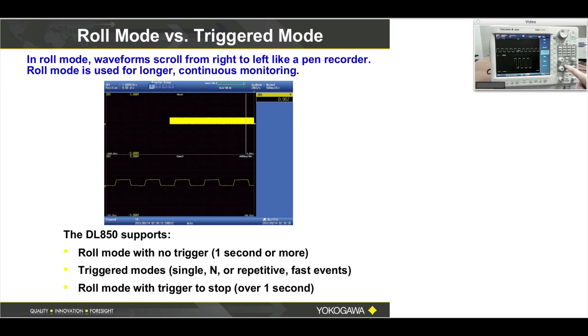Your Trigger button should still be blinking green. If your trigger level — which is indicated by the letter T on the left side of the screen, with a little arrow there — some of you may or may not have a trigger there. We'll set a trigger. There's the letter T and my trigger light's blinking. For those that do not have it, press the Simple Enhanced button, which is right here at my fingertip.